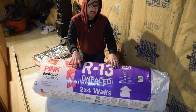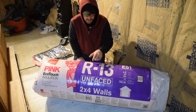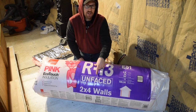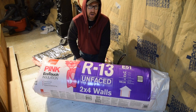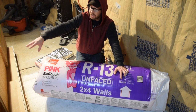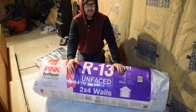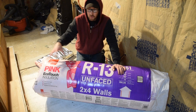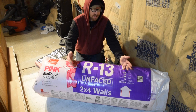The insulation I'm using is R13, which is three-and-a-half-inch thick fiberglass insulation, and most importantly it is unfaced — meaning it doesn't have the paper vapor barrier on one side. I bought one bag of 106 square feet. After putting in all the duct and baffles, those big boxes actually seem much smaller inside, so I think this should be enough to fill all four baffle boxes.